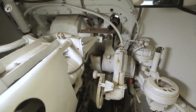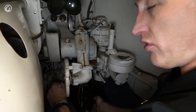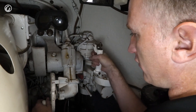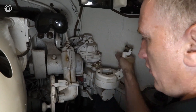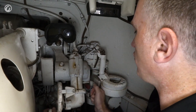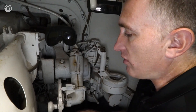Moving to the gunner's seat, which is actually quite comfortable. My left foot rests comfortably on the two foot triggers, my right foot sits slightly under the manual traverse, protected by the skeletonized turret basket rim — stopping my feet from getting crushed as the turret traverses. Under power traverse, a full circle takes about 24 seconds. You can switch to manual traverse mode by pushing down on the release lever, which is fairly quick. For elevation, there's a manual elevation control, but better yet — just like on the M3 — you can disconnect the elevation gearing so the gun is very well balanced and can be used in a stabilized mode.